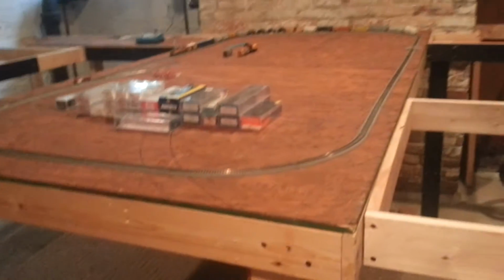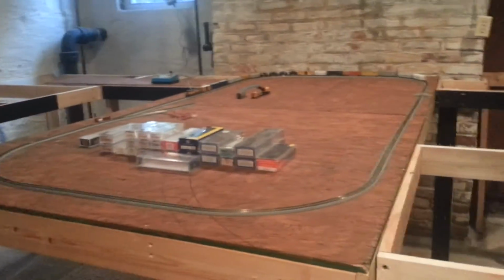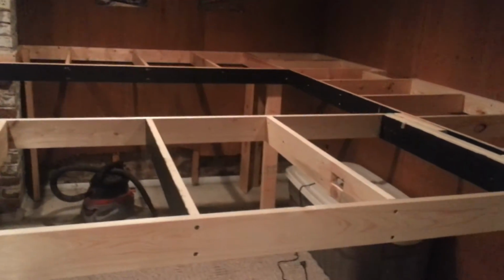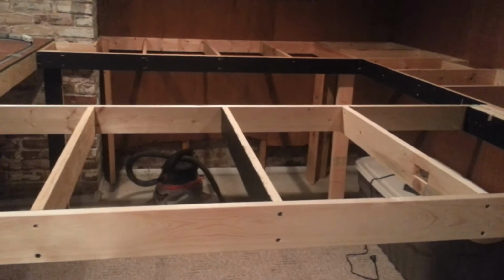I did have to cut that to get down in this basement. My stairs going up are right there, and they go up, and then back up. And I just could not get the 4x8 down here in one sheet. In fact, most all this bench work was brought down here and then assembled down here. So it was all put together with the 1x4s here. They were all put together with the 2-inch wood screws. Where I've used 2x4s, I used the 3-inch wood screws.